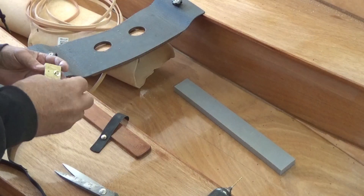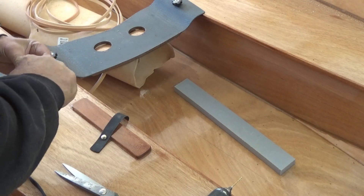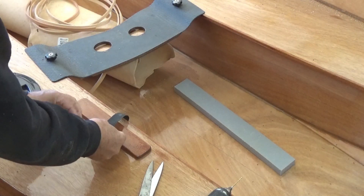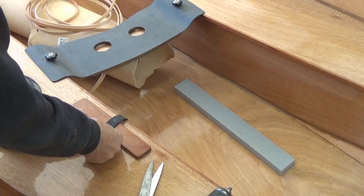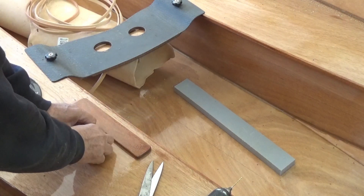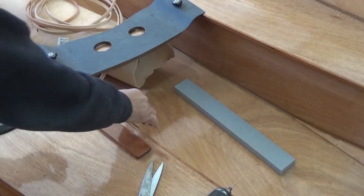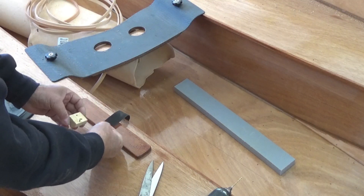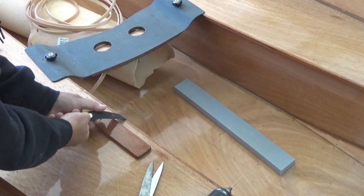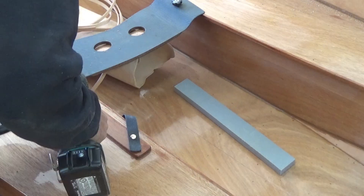I'm wondering whether screwing this down is spreading the head a bit. So I put a piece in some scrap to see if riveting it in there is different. And yes — it snaps in there quite easily. So the screw itself is the problem; we need a pretty small screw. We've set a smaller screw inside the snap, and it snaps in there pretty good. I think that's going to be small enough. Committed now.